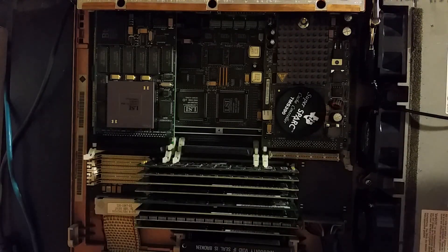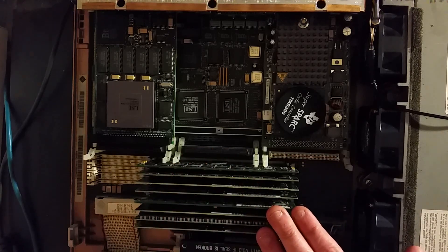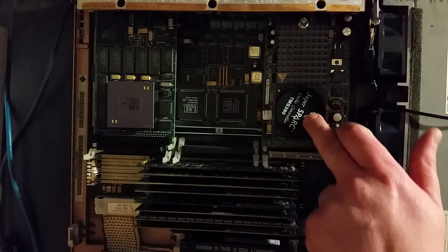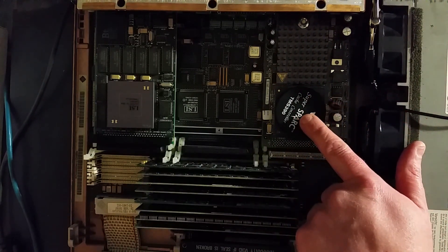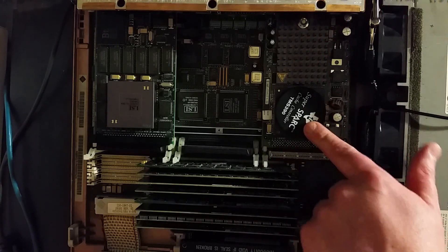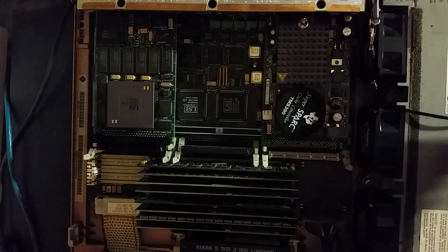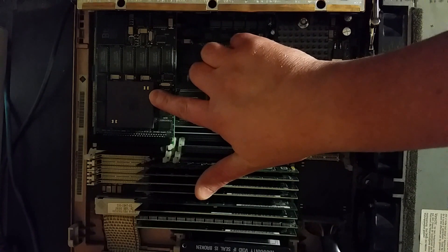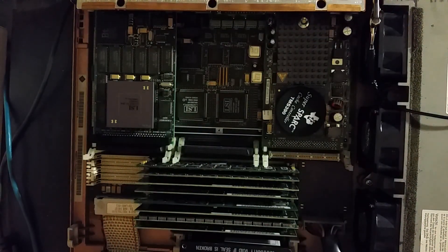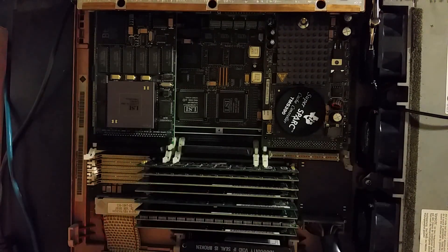Let's take a quick tour of what's inside the SPARCstation — the working bits and pieces. Here are the memory DIMMs, here's the processor, the MBus module — this is an SM51. We're replacing that with one or two Ross 125 MHz modules. Down below is the motherboard, and over here is the graphics adapter frame buffer — that's a CG6, a 256-color 8-bit accelerated card.